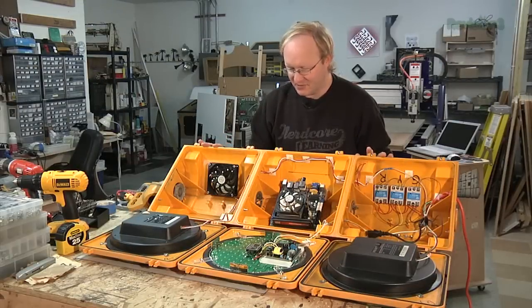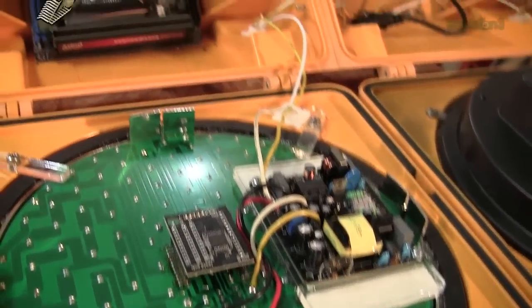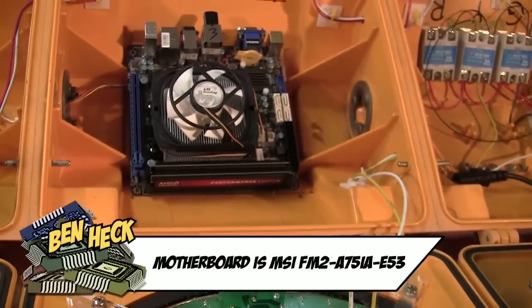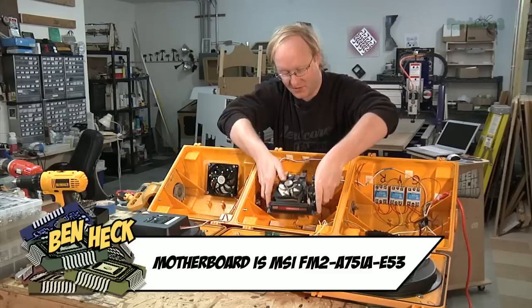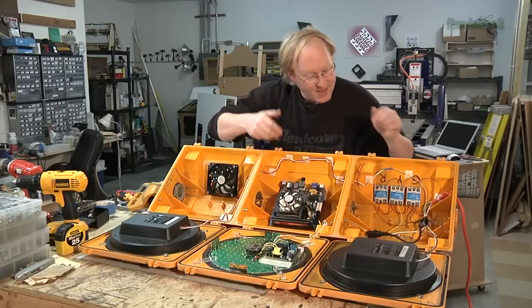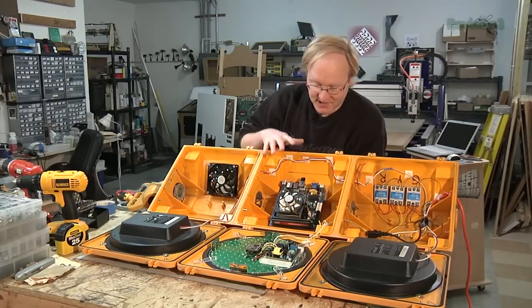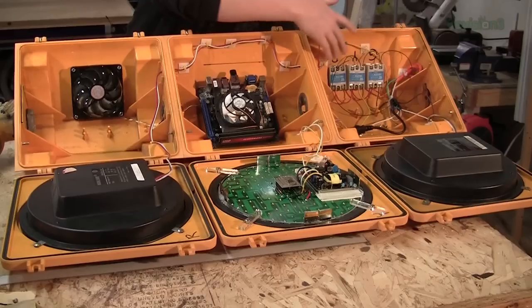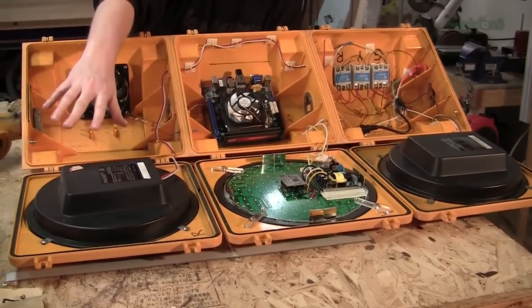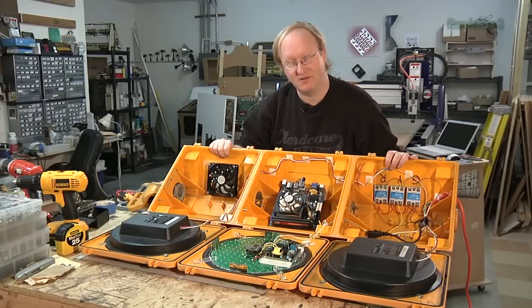Today in Ben News, I'd like to show you this traffic light computer I'm working on for AMD. It's got the AMD APU here on this MSI motherboard. I made these angled 3D-printed supports to hold the motherboard in place, and there are solid-state relays which control the three traffic lights. My idea is this thing is going to pulsate with the music playing off your computer — some op-amps or a microcontroller will control the solid-state relays which will cause these to flash. They're quite bright too, so yes, it'll be a nice party room decoration.